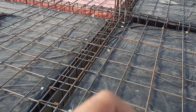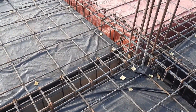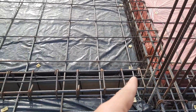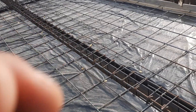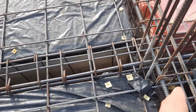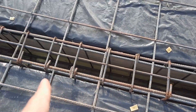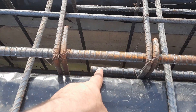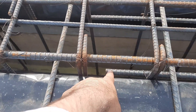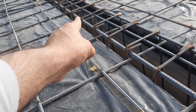The span between two columns is 26 feet, which means the L by 4 distance is 6.5 feet. You can see clearly this is one column, and at the distance of L by 4 — 6.5 feet — we have two side bars of 16 millimeter diameter.